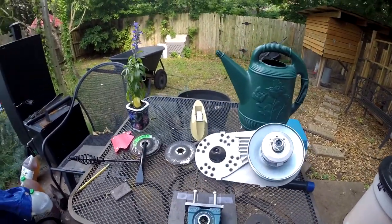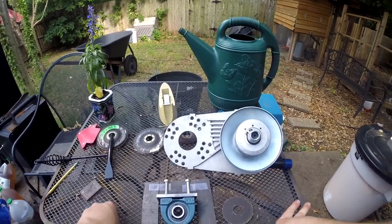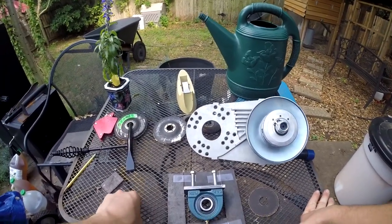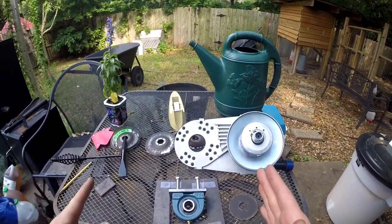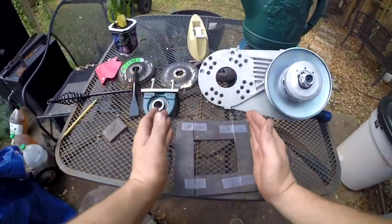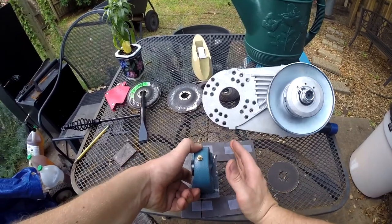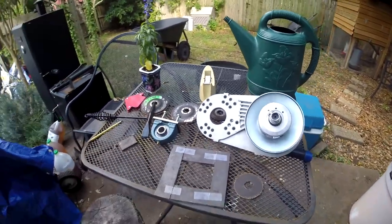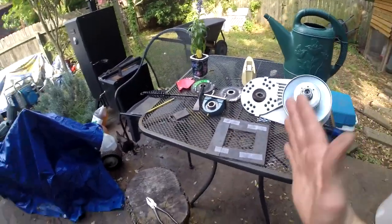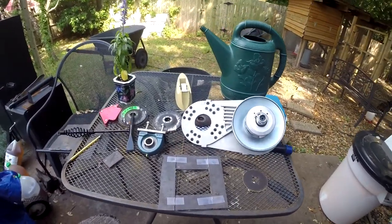Besides the welding still needed, I also need to cut some notches in the swing arms themselves and weld those. After that, I'll get the bearing plates situated and welded to hold a shaft straight. I'll probably do the second jack shaft next since it's really long and I'll need to cut some off — I can use the excess for the swing arm pivot so I don't have to buy separate three-quarter inch rod.